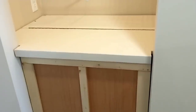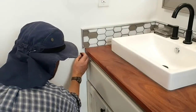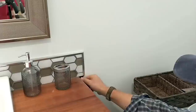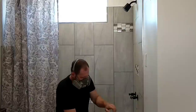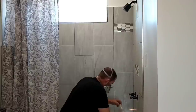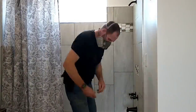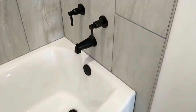Here's the completed look - the cabinet opens nicely with the piano hinge, the back piece is permanently mounted, and you can lift up the front part to access the compartment or remove the front panel entirely. I also fixed a mistake by putting some little mahogany wedges in because the backsplash extended past the edge of the mahogany - I created corner pieces to bring the mahogany out to the edge of the backsplash. The piece of pipe I was waiting for finally came in so I installed the tub spout, and I'm also putting on a low-flow shower head. After that we tested everything and checked for leaks - we now have a fully functioning tub.